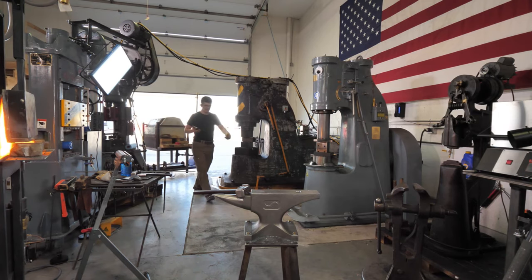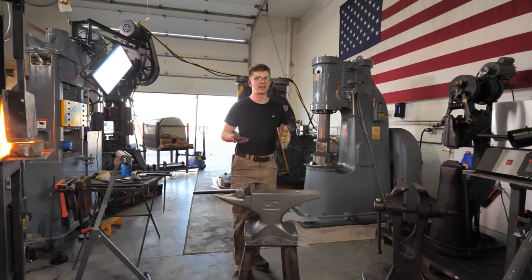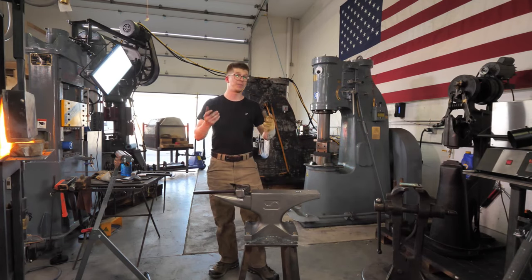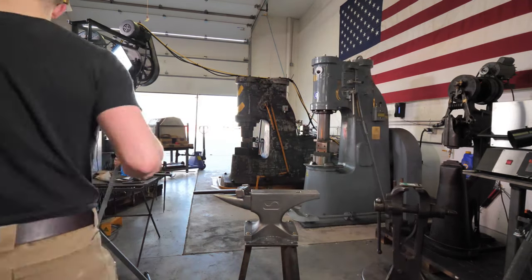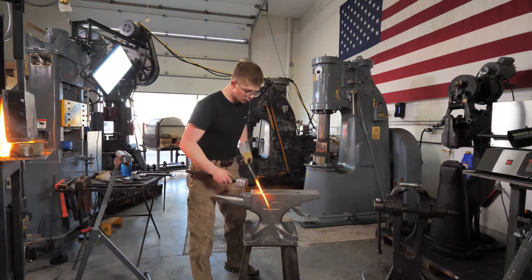So I would start first, like, you know, get cracking, try and make some leaves, make some tapers, things like that. And then you can go ahead and make yourself a round punch from either a piece of coil spring. Go to your local steel supplier, get a piece of 4140 medium carbon steel or equivalent, EN19, EN24 in the UK. And, you know, only needs to be about 5/8 of an inch round or so. And you can make a round punch.